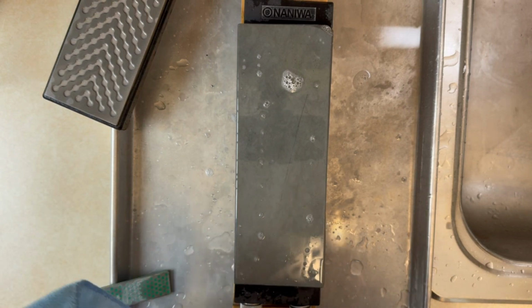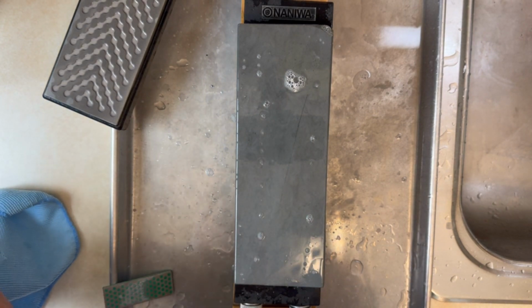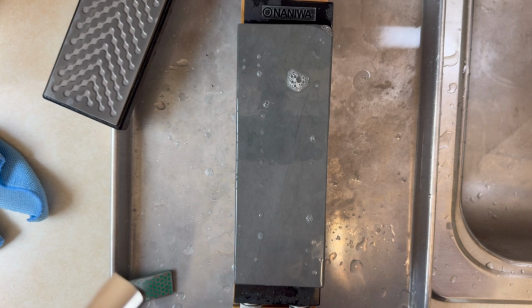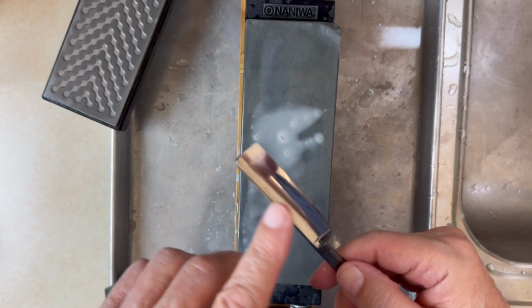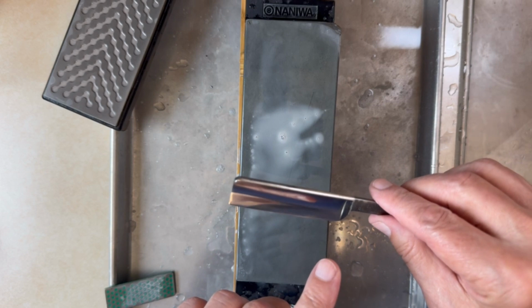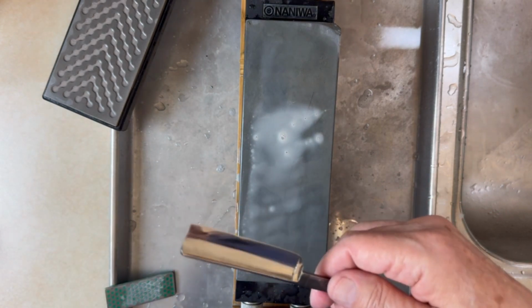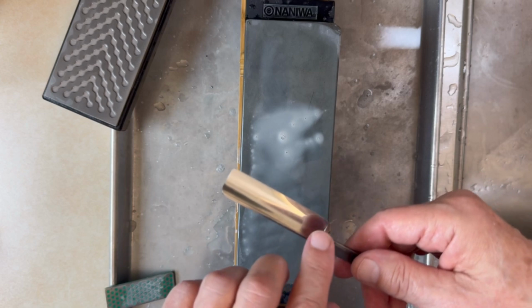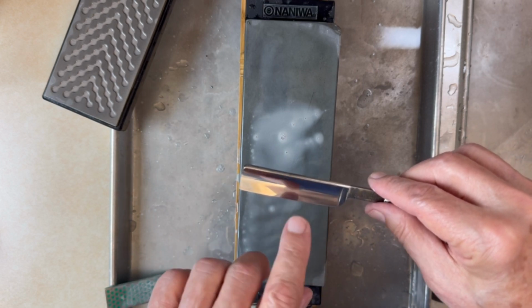Okay, so I'm gonna take a microscope photo of this. Then I'm going to strop it, and then, well, I'll come back after I take the microscope photo. So hang on. Okay, I'm back. Both the actual edge condition, apex condition on the razor look good, but I mentioned when I started out that it appeared that one bevel was much larger than the other, but that I was gonna see how that developed. And under the microscope, the abrasive from the stone is only reaching a tiny area on this side and is reaching what I would consider to be a much more normal area on this side.